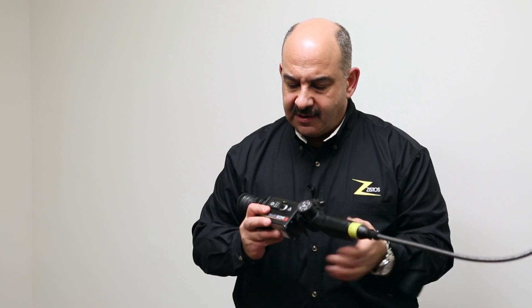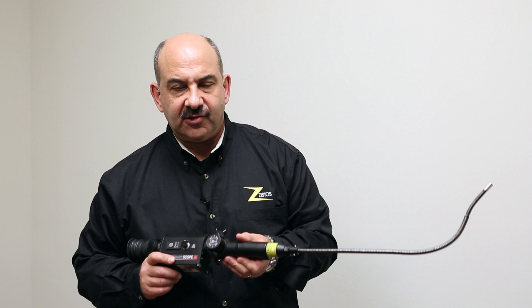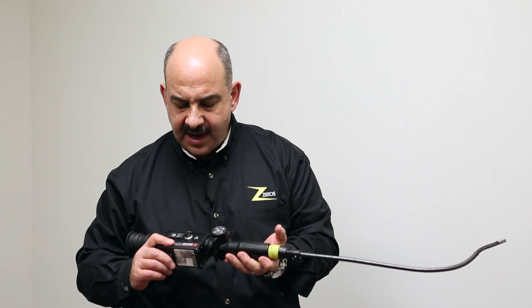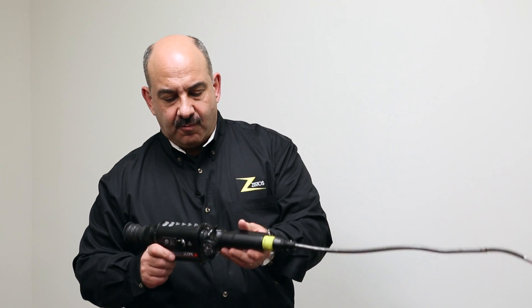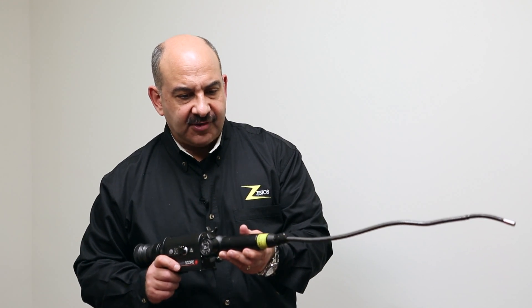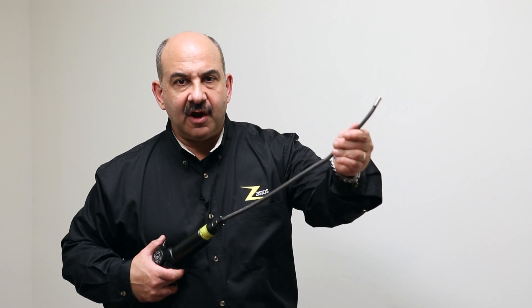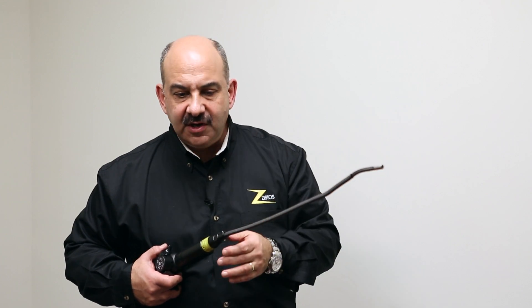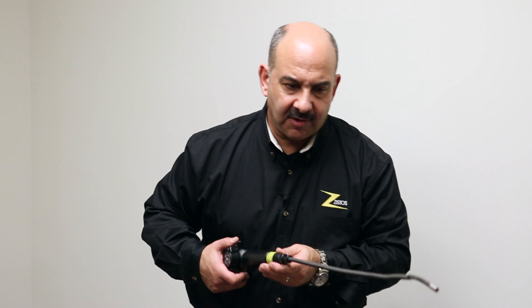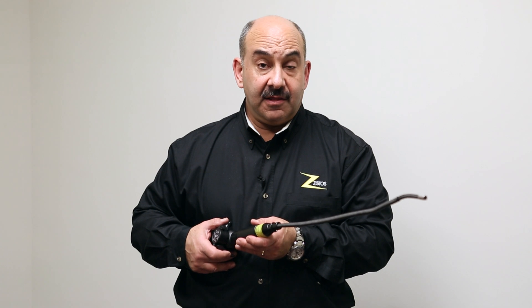This product has a built-in light source. It uses an infrared laser illuminator that is totally covert — 980 nanometers, which is invisible to the human eye. One of the things that makes it unique is that this scope can see 20 feet in a dark void space, which is very unique for a video scope. Most video scopes can't see that far even with a large light source, making this a very good tool to assess a situation in the dark covertly.